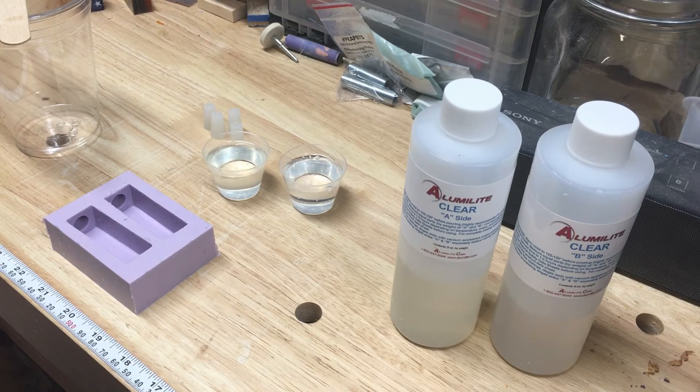Before, I've been using PR resin — polyester resin. A couple of things I love about the Alumilite: the odor factor is way lower. Once this goes in the pressure pot to keep the bubbles out, you've got about two hours set time, whereas the PR takes about 24 hours unless you introduce heat, which is just a lot of extra work. So we're trying something new today.